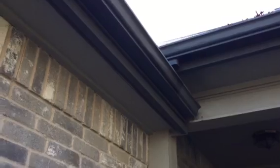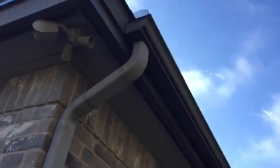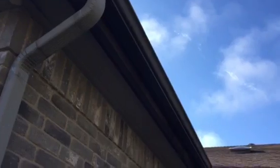Paint the porch ceiling. David's going to take down all the gutter, so there is quite a bit of guttering up everywhere. He's going to take that down before we get here, and that's part of what he's doing. This area right here, soffit looks good, fascia, probably some rot behind there, behind the gutter. You can see they're kind of dripping and water seeping in from the back, so not a great sign there. Probably very likely that we'll have to do some rot repair right up on this stretch right here.